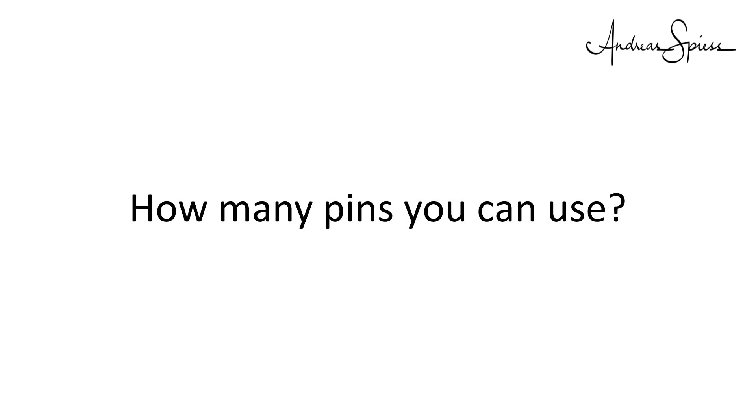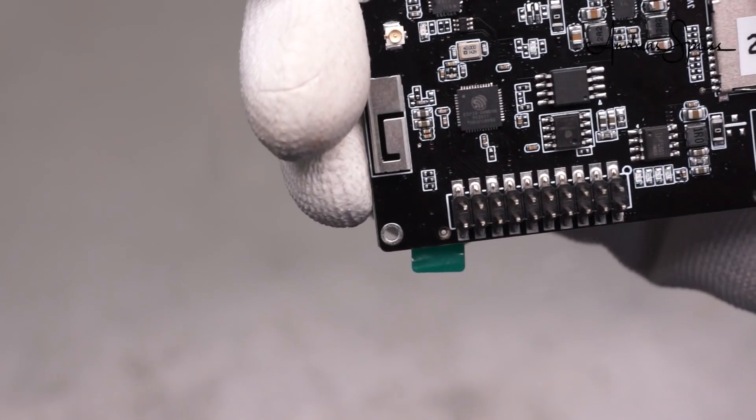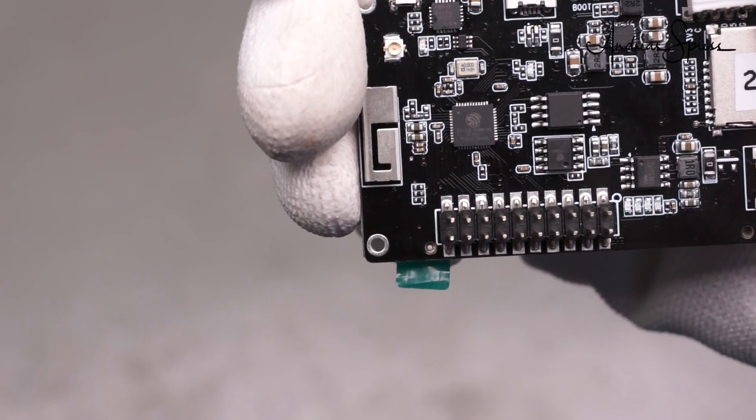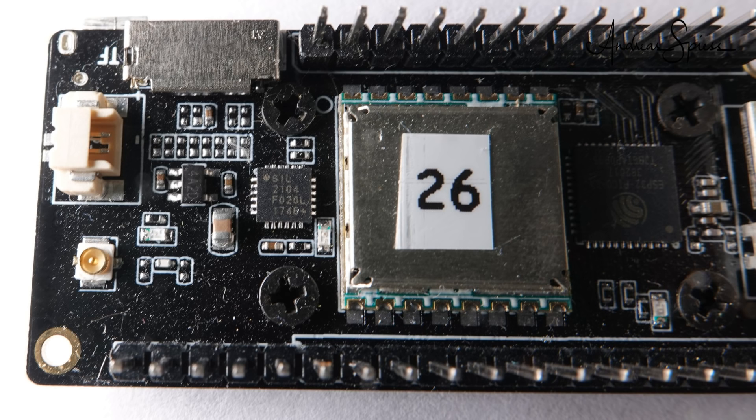Next, you find the number of pins broken out to pin headers. This is important if you need many connectors for your project. The TTGO boards with the big displays have only a few pins broken out, so please check upfront if you have enough available. Two boards come with U.FL or IPX antenna connectors for an external Wi-Fi antenna. This can save your day if you need more reach or if you want to place your ESP in a metal box. The one with the LoRa module also has an IPX connector for the LoRa antenna. Shortly you will find a full review of this module on this channel.